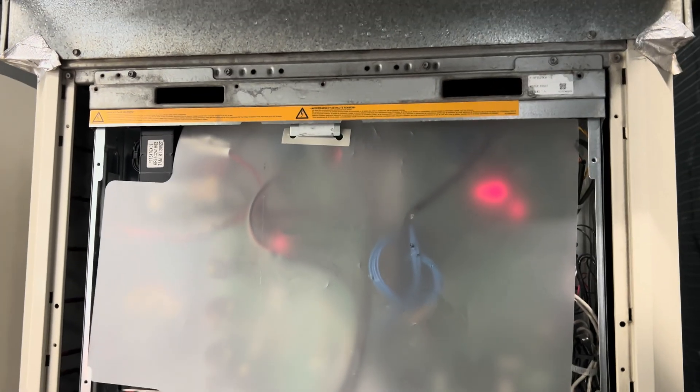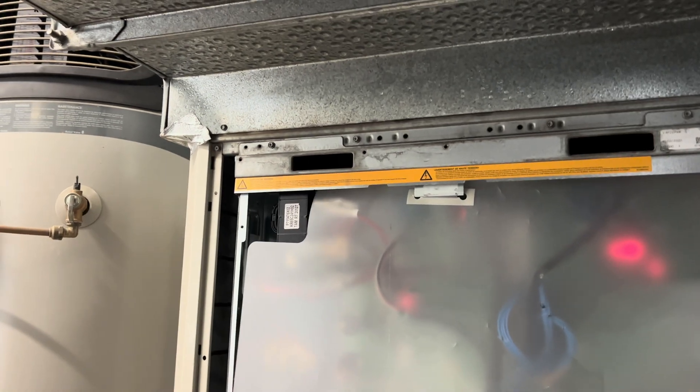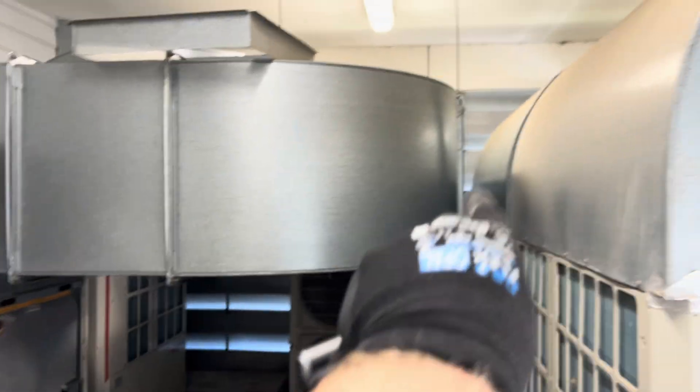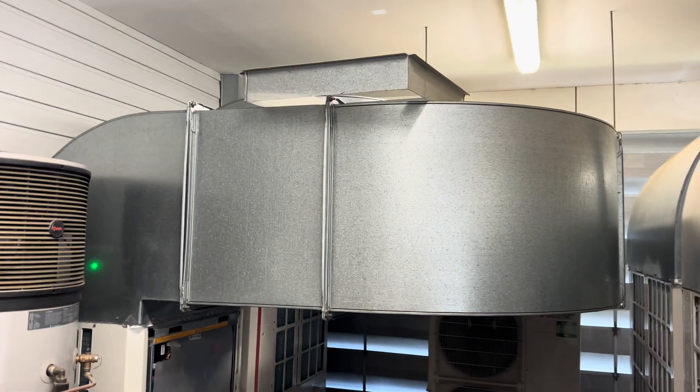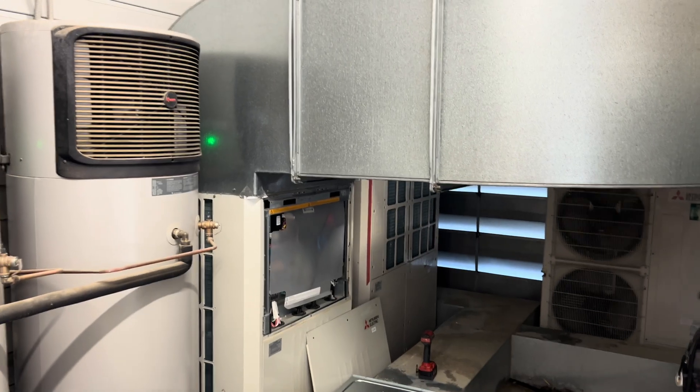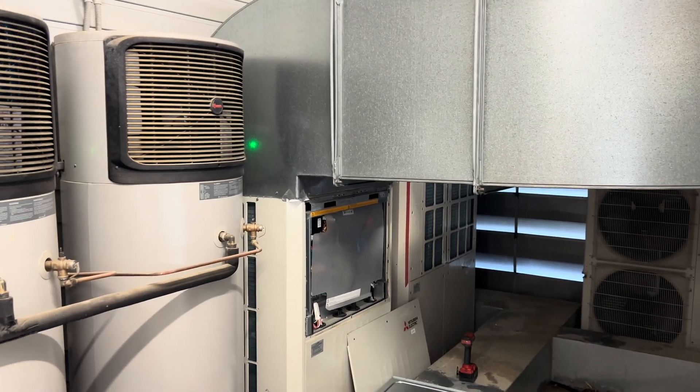On just this one, because it's obviously so severe, I might just change the settings to high static and come back to actually measure it. But honestly it seems like it'd be better for this thing to not have any ductwork on it at all. It's a plant room — maybe we install some extraction fans and just get rid of the ductwork. Either way, I'm going to change the settings now so it at least has a fighting chance, because it sounds like garbage.